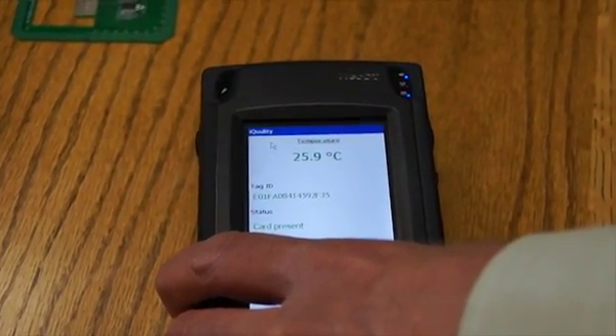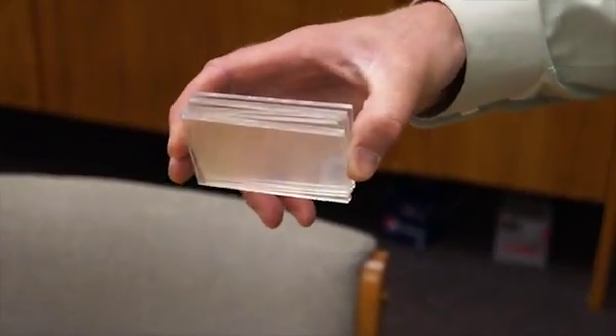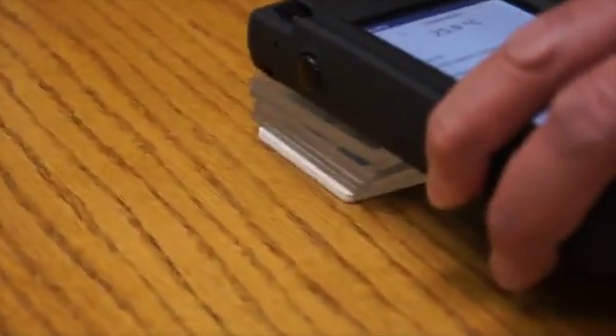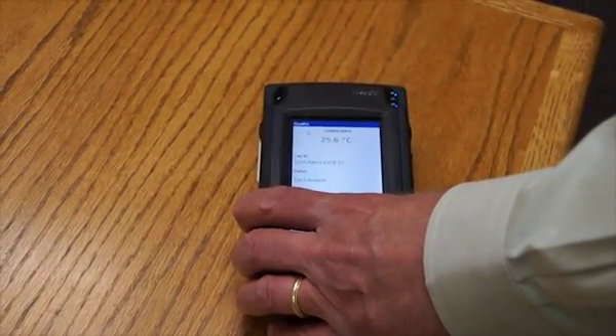This WebDT reader has a little bit weaker RFID field, so that's what we're going to do our demonstrations with, which is kind of a worst case scenario. Just real quickly, to show the performance of our tag, we have seven pieces of plexiglass that are a tenth of an inch thick, and we can very reliably read at that distance. And in different versions of this tag, we can read at even farther distances. But what we find in grocery stores and other places is typically the reader is put right down on the tag, so that read range is not super critical.